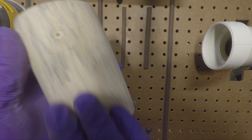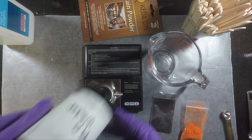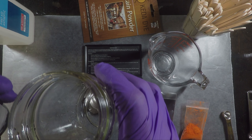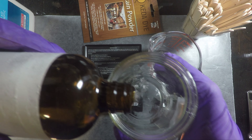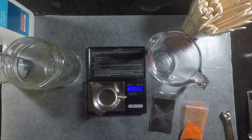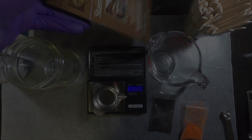The reason I took it off the lathe is because I didn't want cross cuts in my sanding on the wood itself. When you're spinning it on the lathe on my final sand, I always end up with these little cross-cut scratches. So I took it off the lathe to put the 220 grit dual action sander to it, and that's just how I do it. You can do it however you want. This is reverse osmosis water — it's purified water — and I'm using the Keda dye stain wood dye kit.